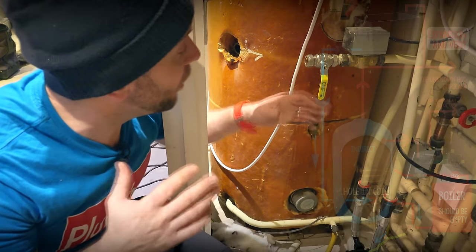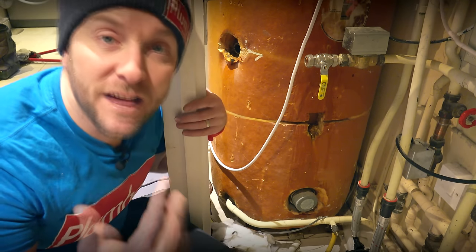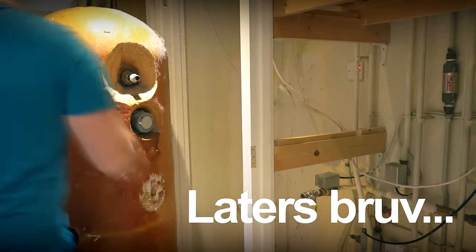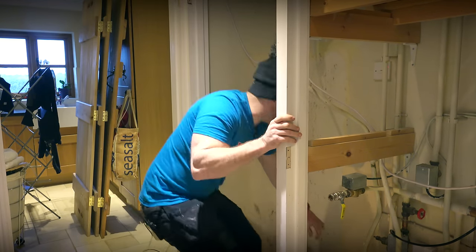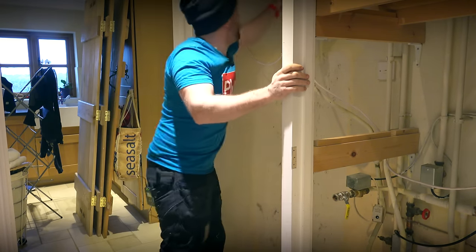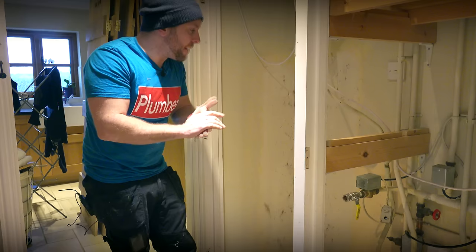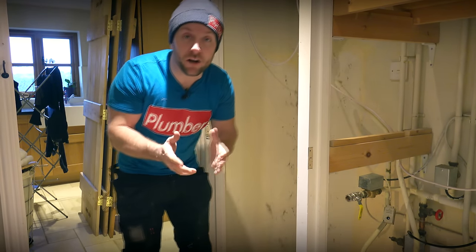So I've popped this valve on here, I've slackened everything off and taken it apart. I'm just going to whip the old tank out. So the old tank is out now. We've got the old cold feed coming down the back here, and they very nicely put a little bit of 15 mil on the drain-off there so we could get at it. Also, the new tank will need a drain-off on there so we can drain the coil. There are two immersion heaters on the old one that have never been used with no electricity supply, so we're not putting them back in — just a blanking plug on the new one.